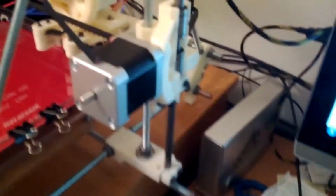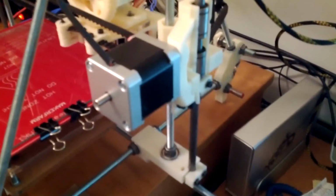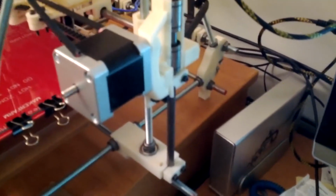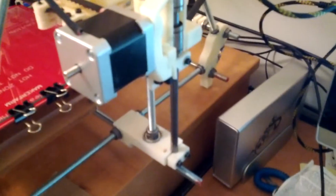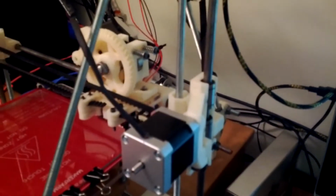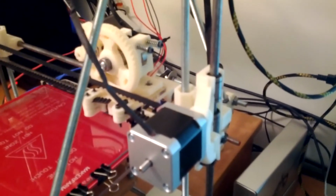And I don't know if the mic's picking up that buzzing. I think it's coming from this motor. Kind of hard to triangulate, but if I do X motions, it changes. Yeah, so all the homing is working with Pronterface, and it'll try to extrude if I tell it to, which is good at least, but I have no idea if it's trying to extrude 5mm or not. I doubt it.